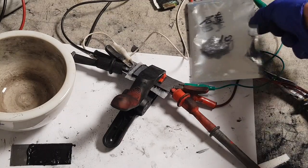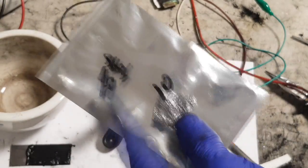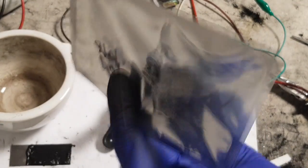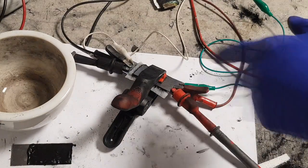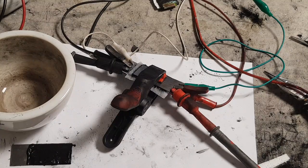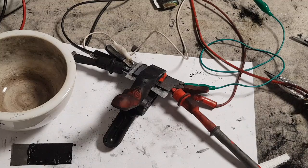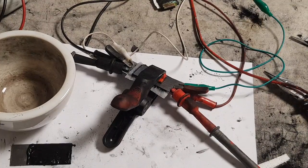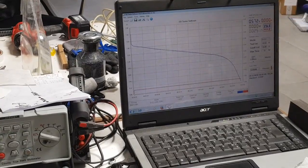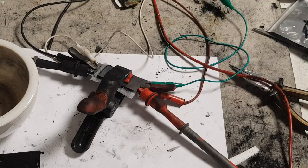I got this silicon from eBay. A friend asked me if I could make a battery that uses silicon, and I will do exactly that. First I tried this supercapacitor design. If I use a standard symmetric design where both the positive and negative electrode are made from activated carbon, I get about half the runtime - around 10 minutes.